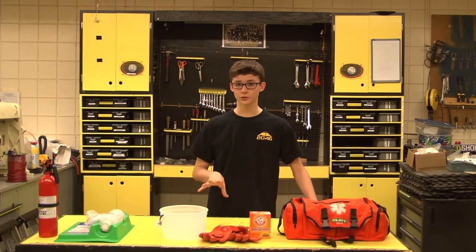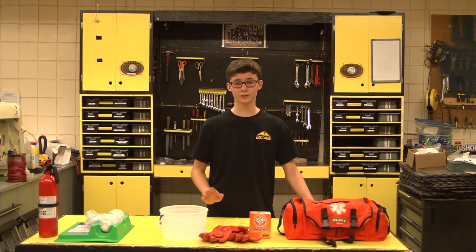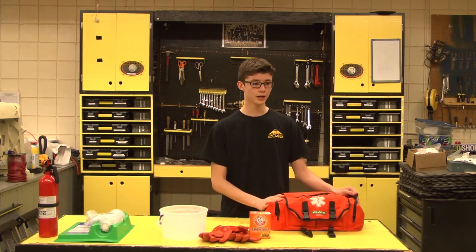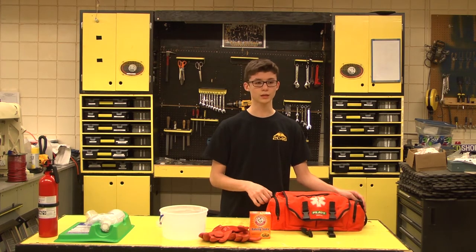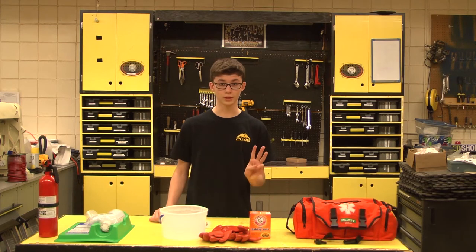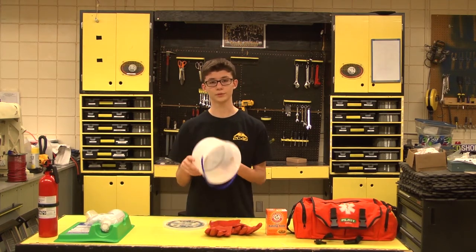Thank you. Hi, I'm Eric, and we're here to talk about general pit safety. Whether you're at competition or back at the robot shop, it's important to remain safe at all times. Ways you can do so: ensure that at your pit you have a first aid kit filled with gauze, band-aids, hydrogen peroxide — whatever it takes to treat cuts. However, in the instance of a leaky battery, you need three things: sodium bicarbonate, acid-resistant gloves, and a container to hold the leaky battery after you've dealt with it properly.